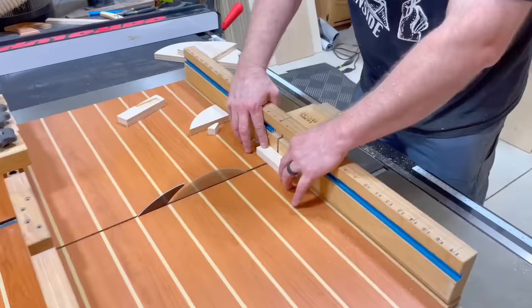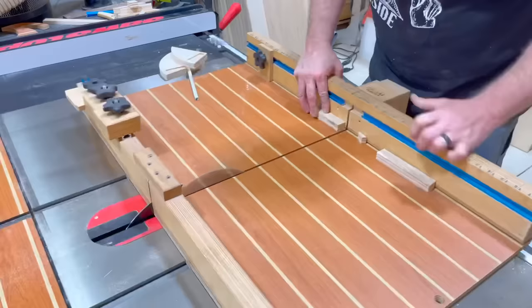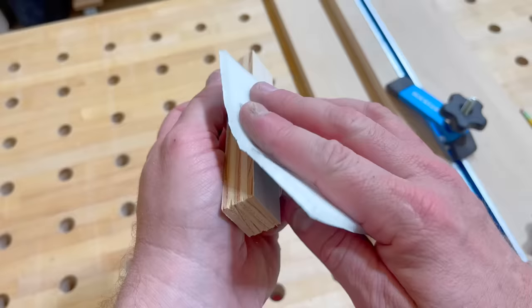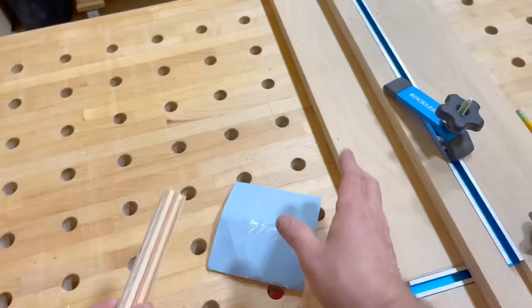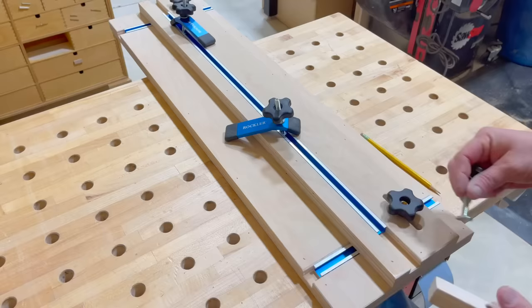Now for the tapering option. I've got some scrap plywood here — I'm cutting these pieces down and assembling them at a 90 degree angle. After this, we take it to the drill press and drill one single hole that's just a little bit bigger in diameter than a T-nut. We sand everything down, make it nice and smooth, then install it. I have a T-nut here with a small circular knob that's a perfect application for this, and we're going to install this stop just like so.